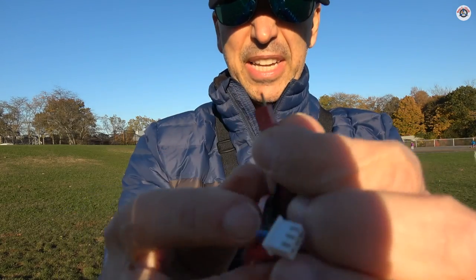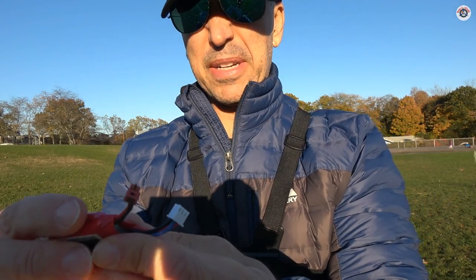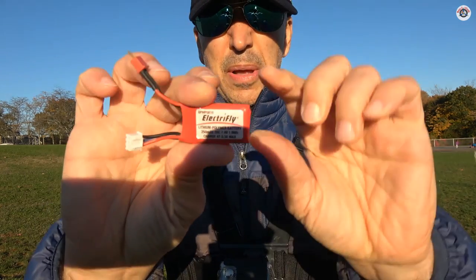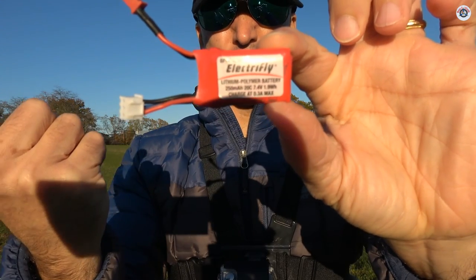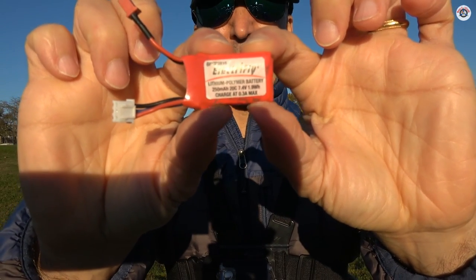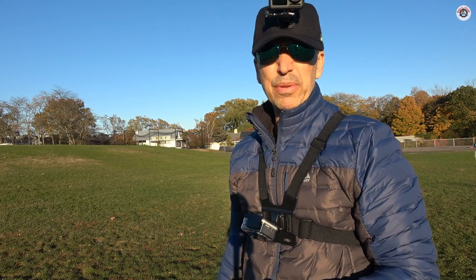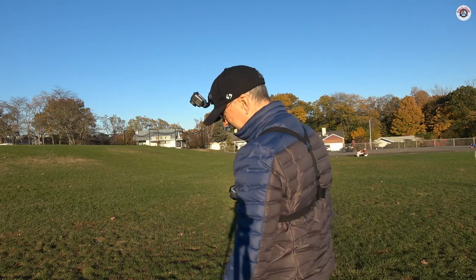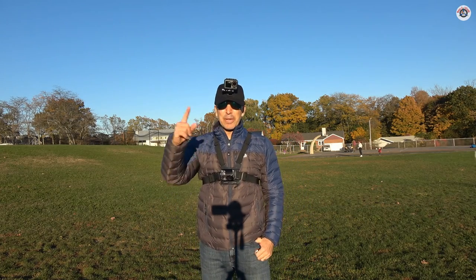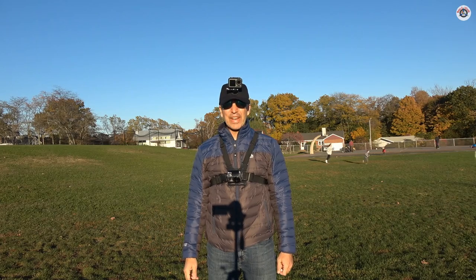The connector is strange — one pin is on one side and the other pin is on the other side, so it can only go in one way. It's from ElectriFly, 250 milliamp-hour, 20C, 2-cell, so a 7.4V little battery. The first thing I'm going to do next is swap this connector — it's a JST connector — and then I can use other batteries that I have. I think I have a 400 or 450 milliamp-hour battery, and if the weight is not too much I may be able to fly a little faster. But hey, it's Budget RC — you have to be flexible with these kinds of things. Thank you very much for watching. If you'd like to see this plane again flying with a fresh battery, let me know in the comments. Stay safe and healthy, hope to see you on the next video — take care, bye bye.